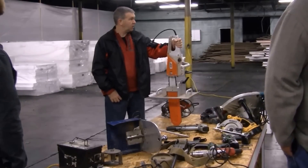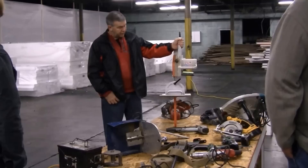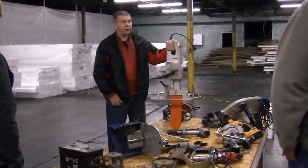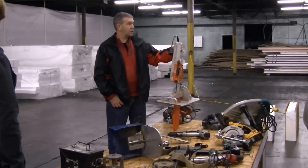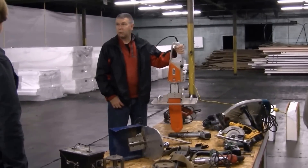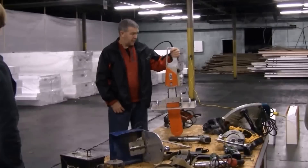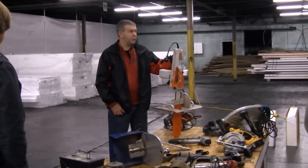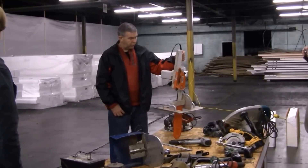I don't care if you use a gas saw. This manufacturer makes three grades of saws. This is actually their largest one, the 220. In most cases we use the 140, which is much smaller, and that's just fine — it'll still get you all the way through the 12-1/2 inch panel. And again, you're not cutting solid oak; you're cutting two sheets of 7/16 OSB.